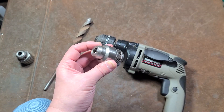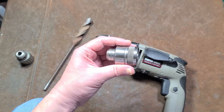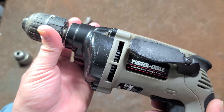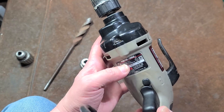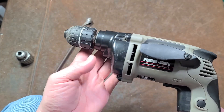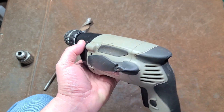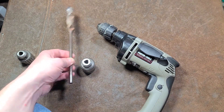Interestingly, a lot of drill manufacturers — including Porter Cable with the old American-made ones — had some half-inch drive versions that came with the half-inch version of these impact chucks. They can be hard on the front bearing. This is all ball and needle bearing construction. When you turn the chuck you can see the fan and motor move in the same direction — double reduction on a 2500 RPM, 7-amp drill. It's interesting they chose a double reduction gearbox, just giving a little bit more gear surface area.